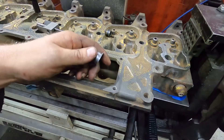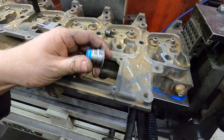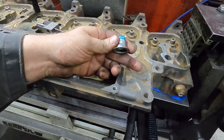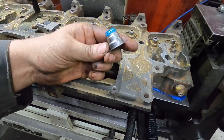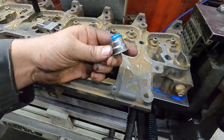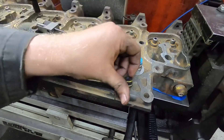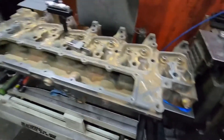This one I have to machine a step down, but it's actually going to be held down by the spring. Because we're not going to put seats in this unless we have to - these are integral seats so they don't come out. This is going to add a shim basically to the bottom of the spring to add more spring pressure. We're always going to be cutting some of that off. These ones under high boost like to pop off, so we're going to machine it for this top hat seal.